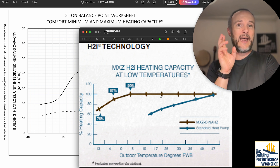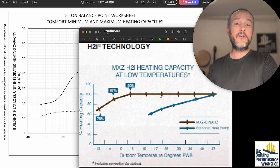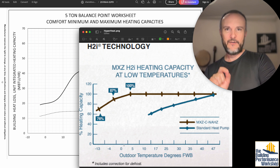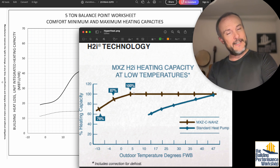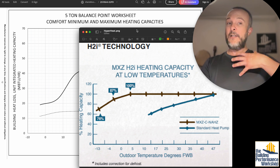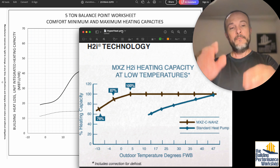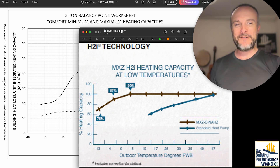This is why we're not worried about the super freezing blizzard day — we're worried about a 17-degree day, which is not out of the question for most places in the U.S., even Texas, where we had that big freeze a couple years ago. Getting a hyperheat system means a flat performance line from 47 degrees all the way down to 17 and below if you need it. Don't think that just because you're not in New Hampshire you don't need hyperheat. People in North Carolina and Atlanta need hyperheat because we get those 20-degree temperatures. Please make sure you're using science as you shop for this. Comment below if you have anything to add about heat pump performance curves and documentation.